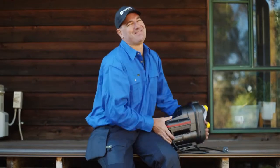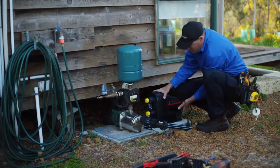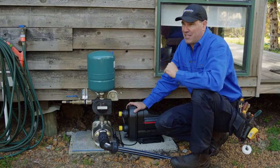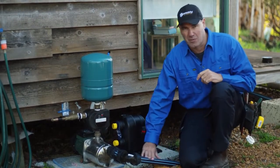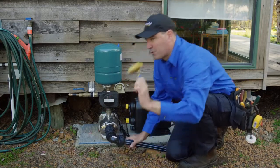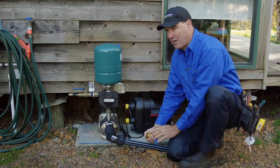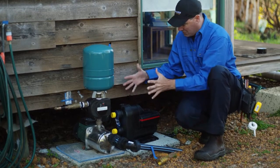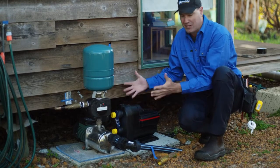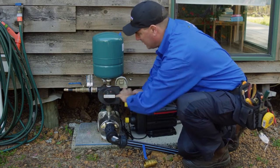Let's get this Scala 2 installed. I've just got to disconnect the old pump and install the new one. I've got a bit of adjustment to do. This is the feed that goes from the rainwater tank. I want to put a 25mm isolation valve in here so that in the future if the pump ever needs to be disconnected, it's easy to shut off. Once that's installed, we'll put the pump in this location here so it's closer to the house and nice and compact. I can get a cover on there later on. I've just got to adjust the piping — probably going to get rid of this valve because we don't really need it anymore, just to clean up the whole section.